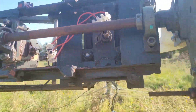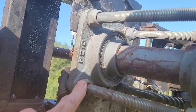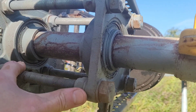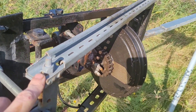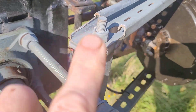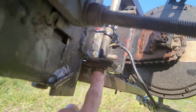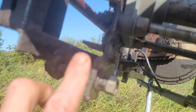Those measurements give you a sense of the scale — it's quite hard to tell how big it is. These two bearings: I was just going to use one but the addition of a second bearing makes this whole thing completely bulletproof, very strong indeed. The strips at the back end of the turbine support it and distribute the weight to the bearings — a very good idea. I made all this to be adjustable, which is why there's a big bolt here that I've never really adjusted, so in future I could do away with that as completely unnecessary.